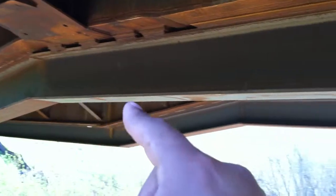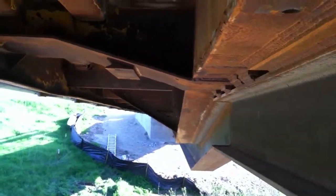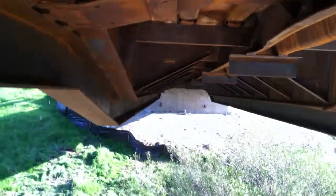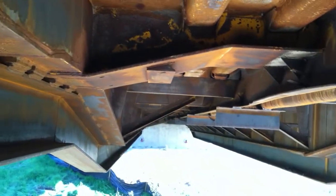They'd go up, they'd bevel up — we can do something like that. We can even fit them inside. Right inside this pocket right here, we can put unistruts, weld them to that C-channel right there, and run your pipes right down that pocket.